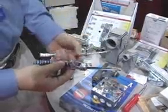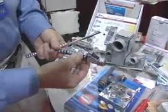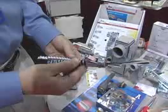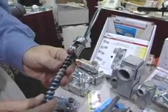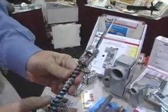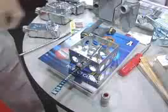Because it does, we actually redesigned the body of the connector so it has greater flexibility — it'll work backward and forward. It'll work on the new style cable as well as the old. With the new design, you can look right down the barrel and see that the spring is fully seated between the convolutions on the cable itself. Then it's just a simple matter — you push it on and push it in, snap to it. That's all there is. Simple as that, and it's reusable.